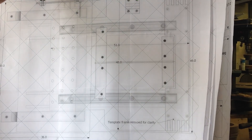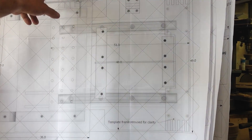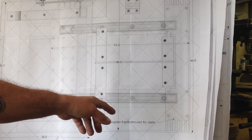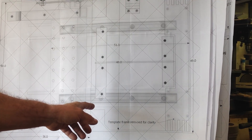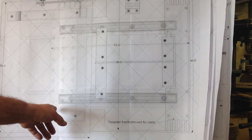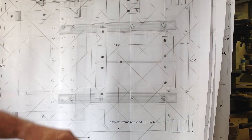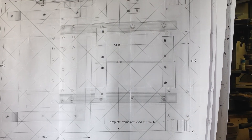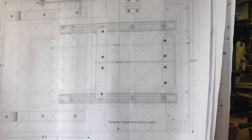And then this is a top view of the whole assembly. We're looking at the whole base plate here — these would be our stops. These are his initial drawer slides, which is where I'm mounting my linear rails, and this is a sliding table outline that sits on top of those. That's what I'm working on today: just getting the two main components cut out and getting started on it. All the dimensions are in metric.